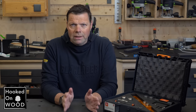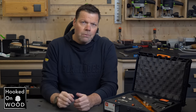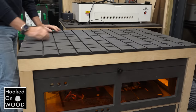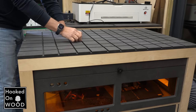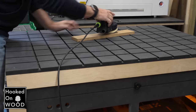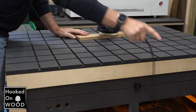As a workbench top, I prefer my workbench surface to be cleaner. When you have dog holes, you will not have a problem when you slide a workpiece on it. But with grooves, there is a chance it sticks behind them. Things like screws fall into these grooves too easily and are difficult to get out again. Your vacuum hose and electrical cables also stick behind these grooves, which is very annoying. So I like dog holes instead.